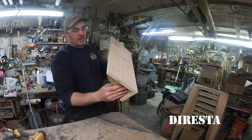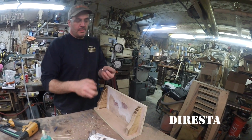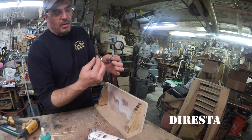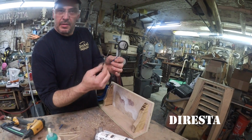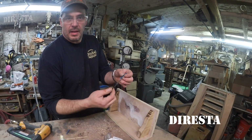All right, now I'm going to hang this shelf on the wall. I'm going to use Tapcons, and Tapcons are great to drill into brick. They come with the drill bit, which is really important because you need to know the right size for the right screw. Take a look at the whole variety. There's a lot to choose from.